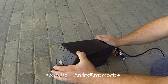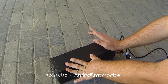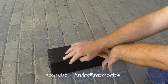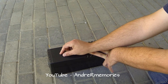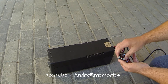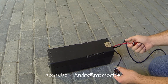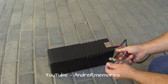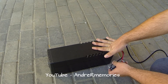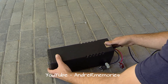This was an old UPS I got from a friend who wanted to toss it because it's not working anymore - it's not going on at all. What I did is I took the positive and the ground from the battery inside and brought them outside, and connected car battery clamps onto it. So you connect it on the positive and negative of a 12 volt battery, and then you can basically run a computer, a light, and maybe a LED TV depending on how big it is.